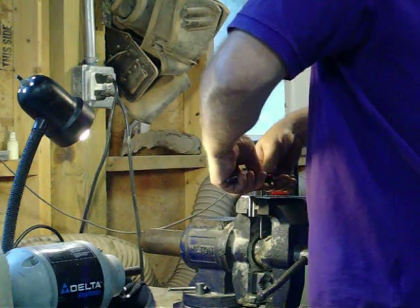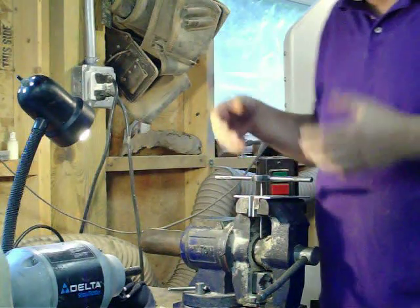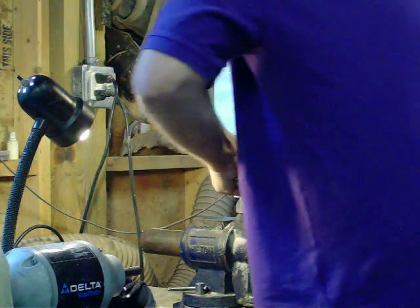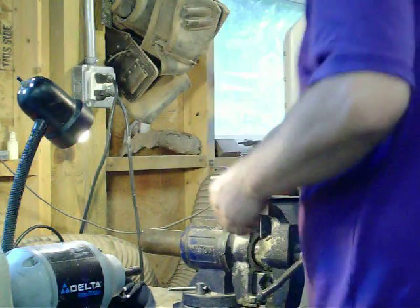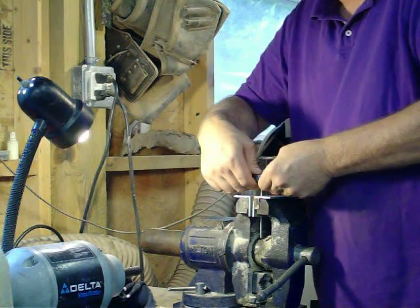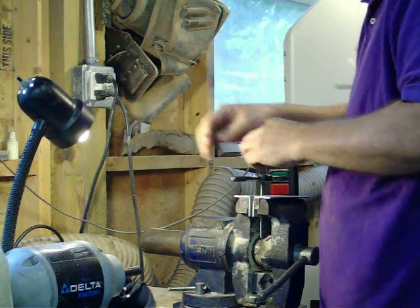I'm going to be pushing straight down on that chamfer. I work with my whole body. That first little quarter turn gets a thread started. Be careful not to rock it — it'll break the starting thread off. Put your fingers back in the center again and on another quarter turn. You can really tell that it's starting to get on there now. By the time I've gotten to three-quarters of a turn, I like to go at least one time around before I back it up. Then I back it up until I feel the thread break — you'll feel like a little hump. And that's breaking out that chip from the thread that we're forming.